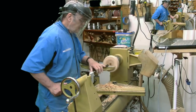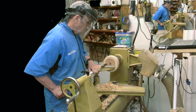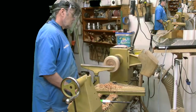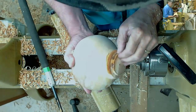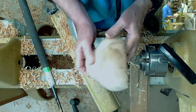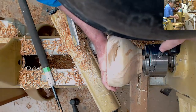Cutting with the left tip here. The flute was straight up — it would be at noon, whereas we're shooting at somewhere close to one o'clock. The chuck came loose — let's take it out and evaluate it. The reason why is because I have so much bark here; it was compressing more on one side, and once it compressed, it lost its hold. Which leads me to believe I probably do need to take this down and get rid of this bark. The challenge is I can't use the screw chuck easily anymore, so I'm just going to put this in as best I can for the time being.